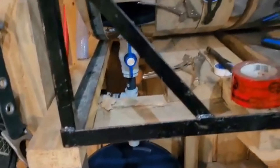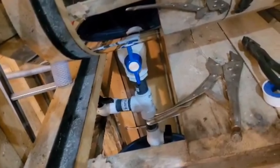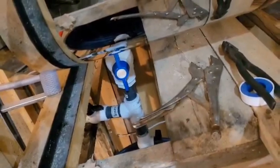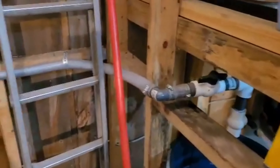Now here we go — this is the head tank, we pump it up in here. Like today, this was gathered last night, it's pretty clear stuff, still looking good. There's a filter there to get all the dirty stuff out — wood chips and all that. As it comes through the head tank, I've got a couple valves: the one on the bottom so I can shut the feed off, and another so I can wash the tank every time it goes empty, nice and clean.